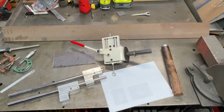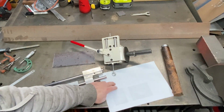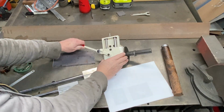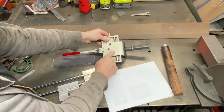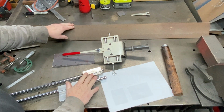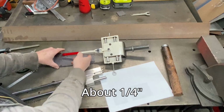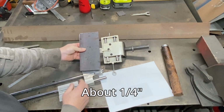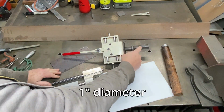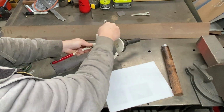I've gone and got some of the materials for the jig, and I was going to write some diagrams up here on the bit of paper. But from what I see on the device itself, there's 4 main pieces. So there's this piece here, the slide, and the metal bracket that goes around the corner. I have the linear rails for that, and this piece of 100 by 100 angle to use for that metal bracket. The next piece is the housing itself, and I've got this 6mm plate, and there will be some sides put on it and some ends, so that'll be fabricated. There's the shaft that goes down here, so that's the piece that I'm going to use for that. And the last bit is the bracket that holds the drill.